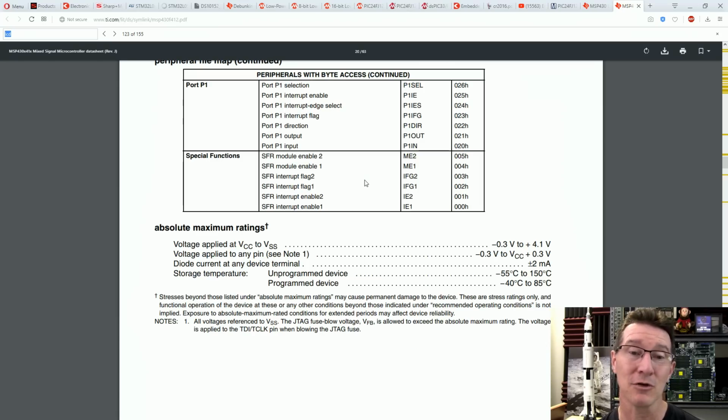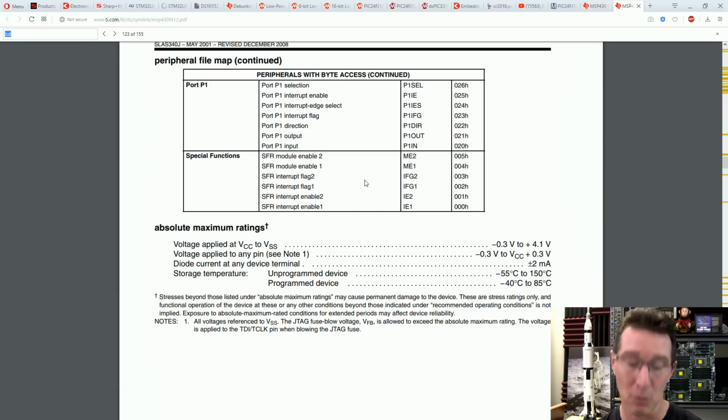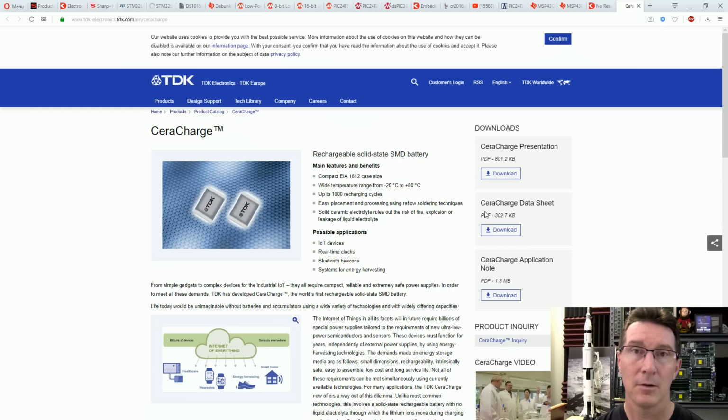It could be a cheaper solution, but it's bigger, more overkill than this little job, as I said, with a 3-cent micro. Right, so let's assume that we've got either of those solutions, and we're talking in the order of like 2 microamps standby consumption. Don't worry about when it powers up and all that sort of jazz.